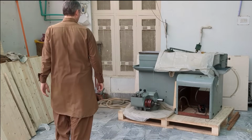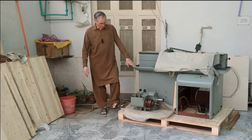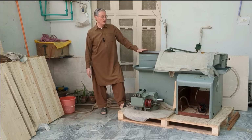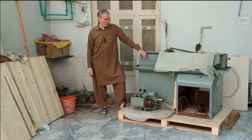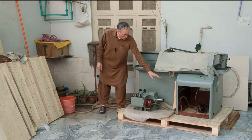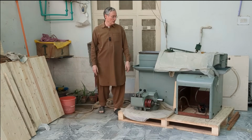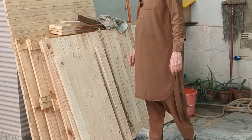You can see we've made a start loading items onto the pallet while keeping the center of gravity as low as possible. Immediately over the top of the headstock I'm going to place a shelf for other heavy items and also put as much as possible inside the stand. The only exception to this was the bed, and for dimensional reasons it could only fit on top of the stand.